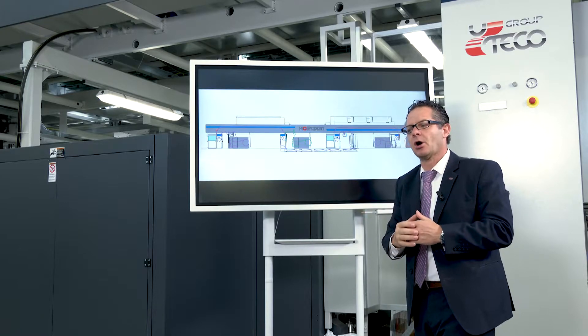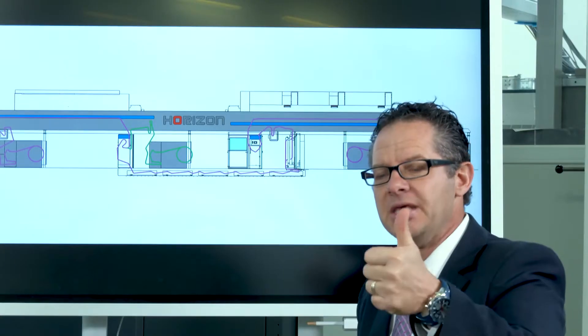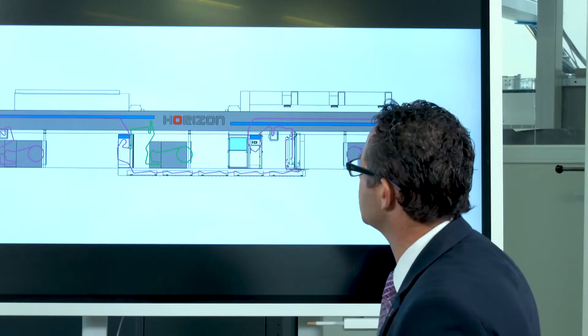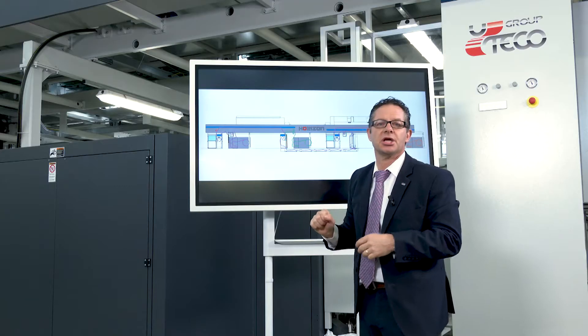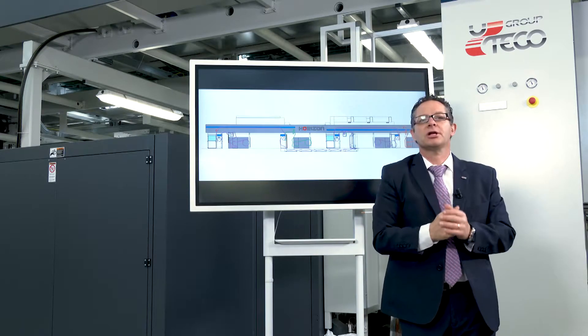This whole process creates a subject that is the gummy bear in a chip bag — it's artwork we created that has both on it. So you have three materials laminated: PET, MET-PET, and LDPE. We have our tension zones from each area from all these treaters and infeed and intermediate groups. This is the web path, and from here we're going to start running the machine.